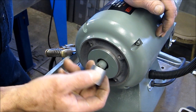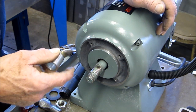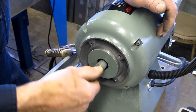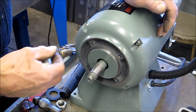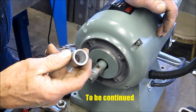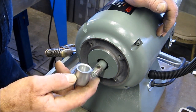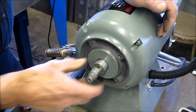Now we've got a couple of choices. I look in there and this is going against a shielded bearing, just like those shielded bearings I pulled out of the top of that Wilton machine. Right now they're running fine — there are perfect bearings in there. So do I pull this apart and change those out now? I can get in there and change them later. So what do we want to do — face this off and give it a try, or go ahead and make something that's right? Let me give it some thought.